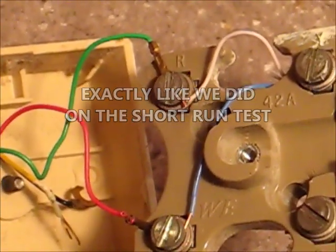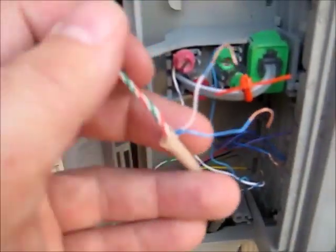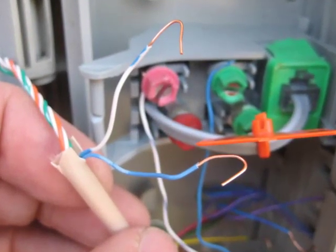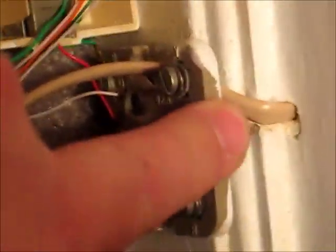Connected to the terminals, connected to the green and red. There's no sense hooking that into the wall until I make sure we've got dial tone, so let's hook up the outside. There's the other four we're not using — there's the white and the white-with-blue-stripe and blue, and we're going to connect them right to that. The moment of truth: we're plugged in. Hey, how about that! Now it's just a matter of putting this thing nicely back in the wall — and that's just screws, putting that in there, tightening those up, and that's firmly on the wall.